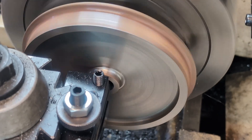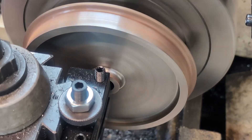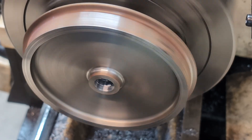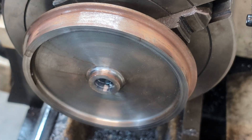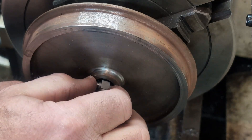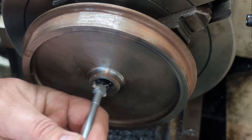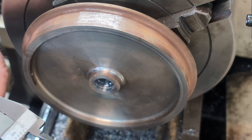We started at six hundred thousandths, and I know that because I measured it before I put it on the machine. I've got an ugly spiral there — this isn't my final pass. I'll check the bore with the snap gauge. We're at six forty five.